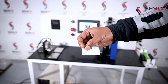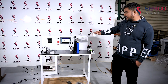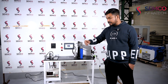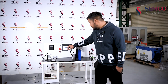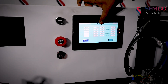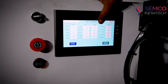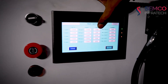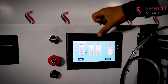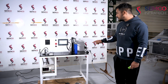Basically, how this machine is going to sort — we have four to five levels. Whatever voltage and internal resistance values come in, they fall under a level. As you can see in the software sort settings, the first gear voltage range is set from 3.0 to 3.35V, and the IR range is set from 2 to 3 mΩ. Since the reading was around 2.71 mΩ, it comes under first gear — that's why it is written LV1. Now moving further, this one is a prismatic cell.